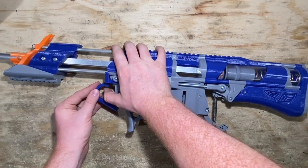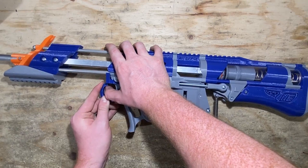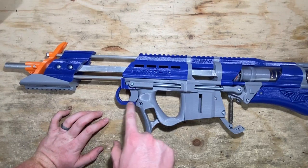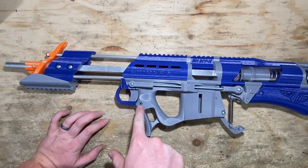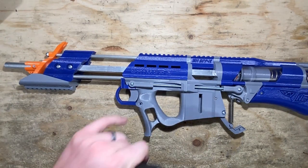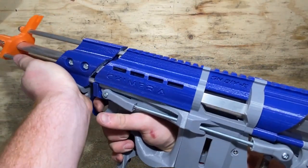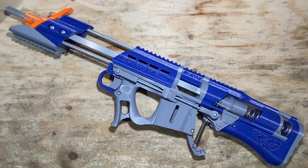This is going to fit into this little groove on this other blue piece, and then slide into the handle. It's going to be a tight fit, at least on these prints. We've got that in place. Make sure it's at a good angle — the line on the bottom of the trigger should be parallel with this part of the trigger guard. We don't want it pushing up because then the trigger can rub on it. Because I trimmed this, I'm going to quickly drill a new hole, but for you, you're just going to put in a 3/4-inch screw straight through to the other side, decently snug. There's our trigger guard — if we prime it, we see that it doesn't get in the way, and we can do a full prime action. Oh — it fits!